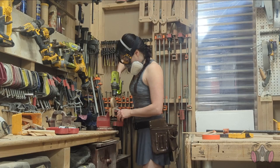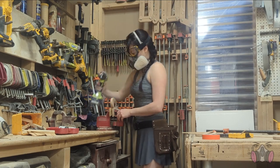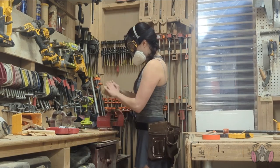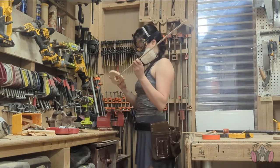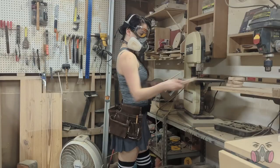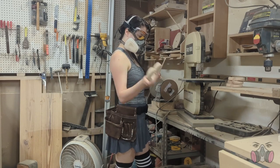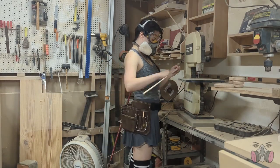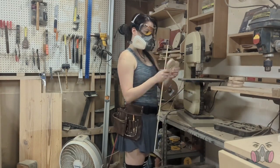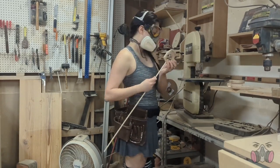I also want to make a note here: for anyone that frequents my channel, you probably know that I'm a big fan of repurposing scraps. But not for this. Or more specifically, if you do use scraps, make sure you know where they came from and that they're from a larger piece that you bought, not found. This is because if you don't know where the original wood came from, you don't know if it was treated with insecticides in order to prevent infestation while sitting in a warehouse. You risk introducing those things into your food or to a child. So if you don't know where the scraps came from, just save them for a different project.